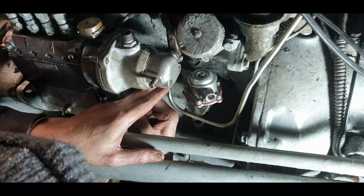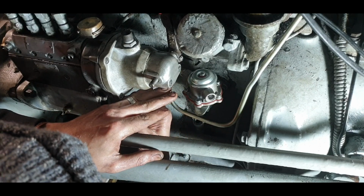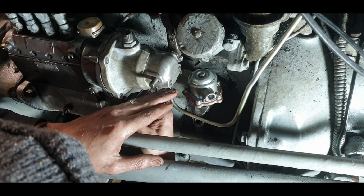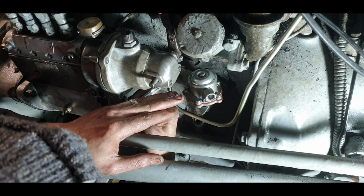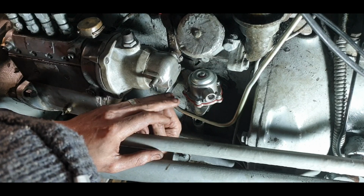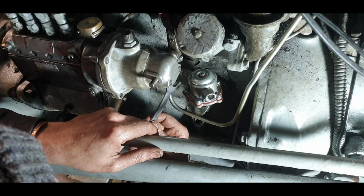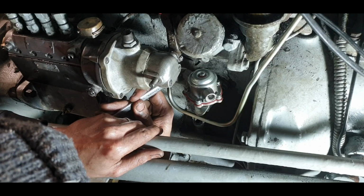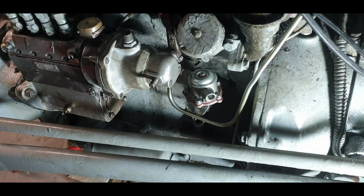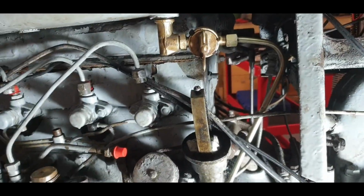So, these are an Agri-Line part 7557. I just seen it written on the packet, and I have to give it to them, they're top quality. There's some other makes that do these pipes, and you have to put a rubber seal on the end of them. These are just an olive, so I never over tighten these. Let it leak and tighten it till it stops, instead of going too tight, because if you take it off again, you are in bother.